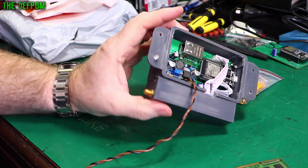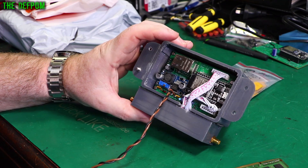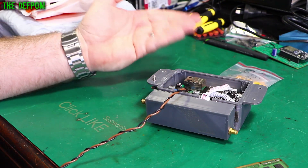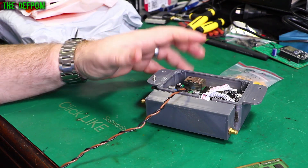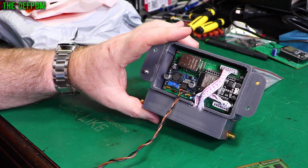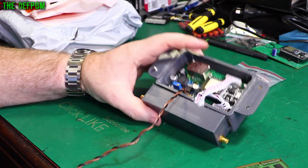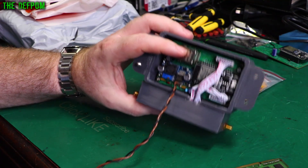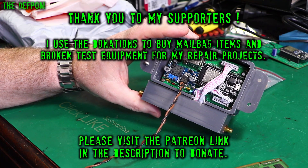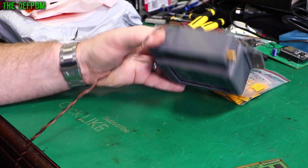I always wanted to have a LAN version instead, so this time I've got a LAN adapter. But I'm having some problems getting it working — it's been a bit of a pain. I can actually get the network to communicate; with an ethernet cable plugged in I can communicate with the internet and get NTP time. That works. But it seems that when I've got the ethernet module enabled in the software on the ESP32, it locks the serial ports — they're getting blocked. I can't talk to the computer, can't get any serial feedback, and the LoRa modules which are also using serial are also not communicating. It's almost as though there's some kind of conflict between the ESP32 ethernet system and the serial system. So I'm trying to figure out what's causing that — that would be another interesting video.